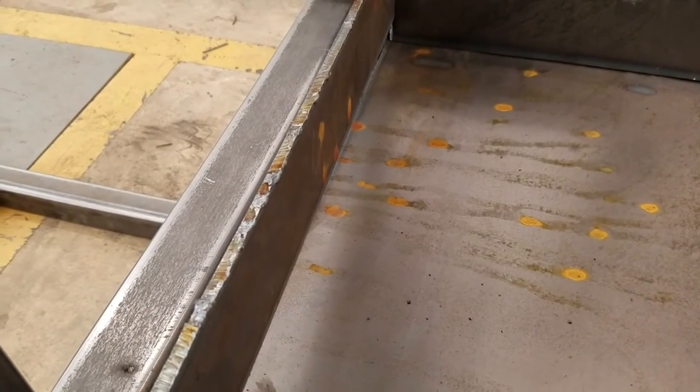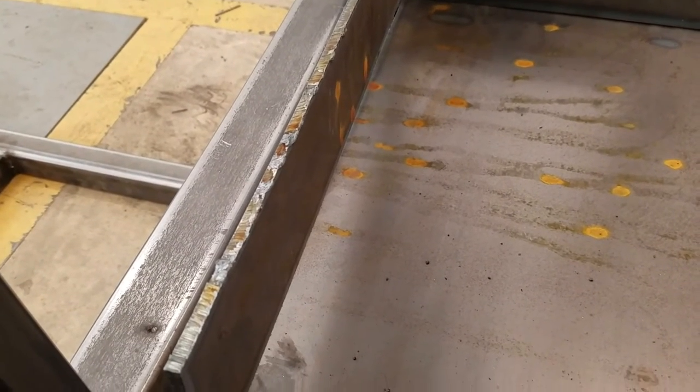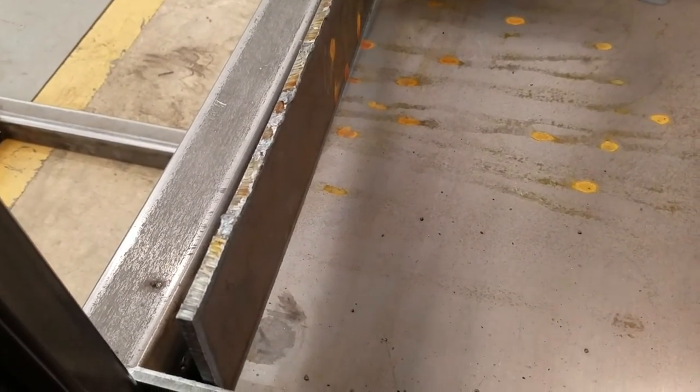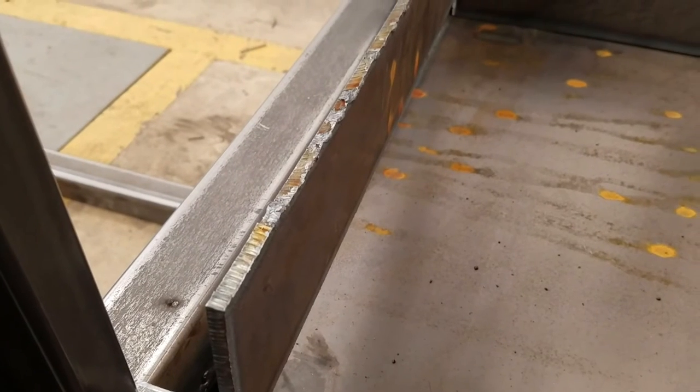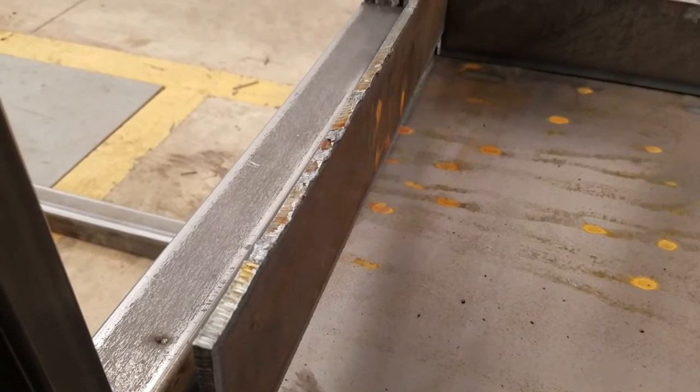We've got to do a little bit of grinding to get a snug fit on these side panels. I wanted to cut it close with the plasma and then grind to fit. That top cut doesn't look too great so we're probably going to flip that over, because that was a freehand cut. We've got a torch track which you can set the speed on — you put the plasma on there and you get a really nice, even, straight, very consistent cut. It just takes a little while to set up, so when I just had two cuts to make I freehand it with a straight edge, and the finish is not nearly as smooth.